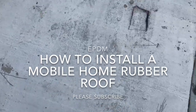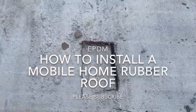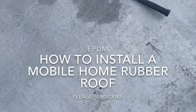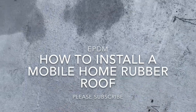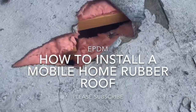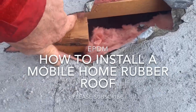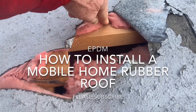I cut a hole in the roof so I know what's going on. Check it out — see this right here? There's a big bump right here. There's a two-by-four on the flat running here — let me show you. There's a two-by-four laying down here on the flat; looks like they ripped it in half, and there's another one right here — they put them on top of the rafters.